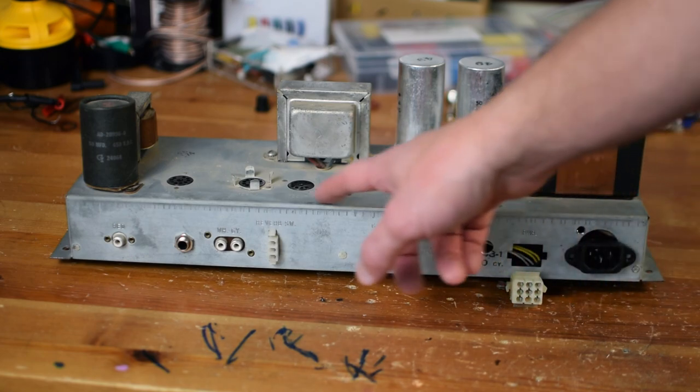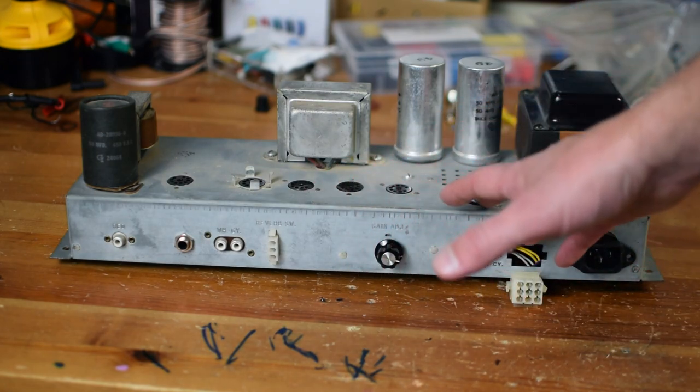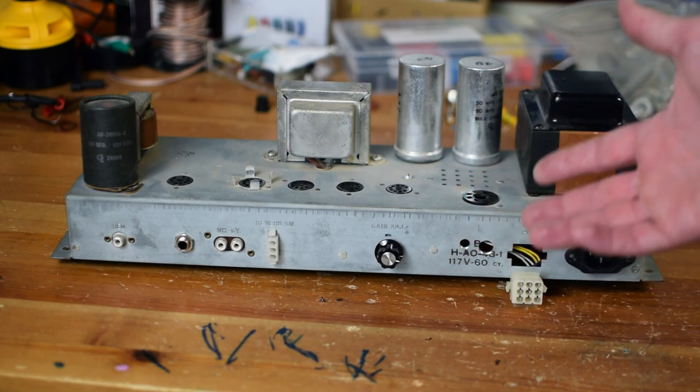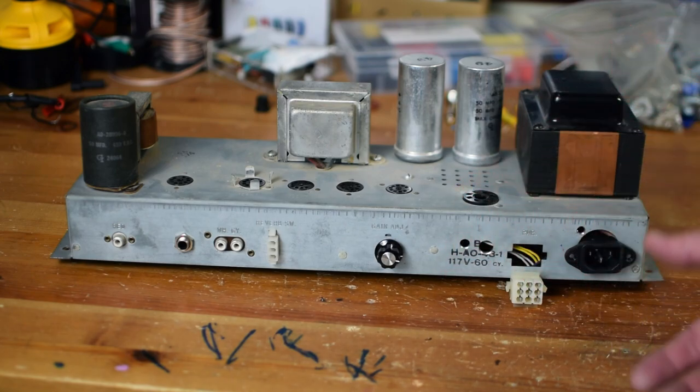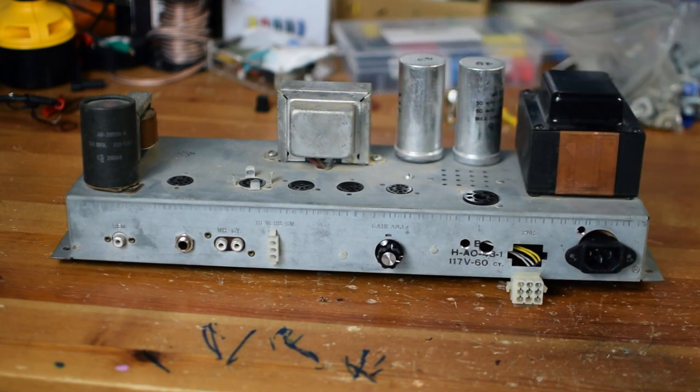A lot of the time the tube complement is very easy to transfer to a guitar amp, and vintage tubes often are really good, so if you can find one with tubes in it, that's awesome. Even if you can't, the chassis and the transformers are usually excellent and very workable, and that in and of itself can get you $200 or $300 into a project for a lot less when you get the Hammond set up. So I would highly recommend it.